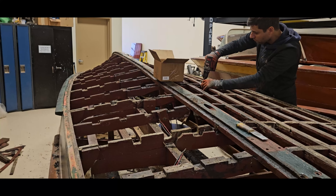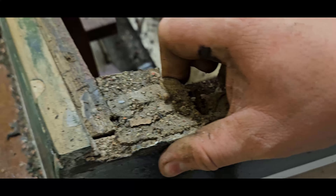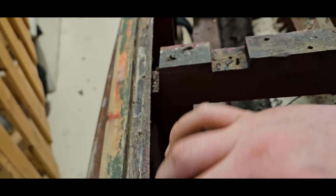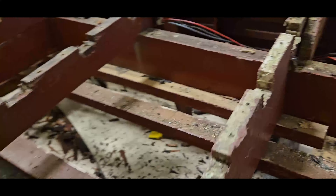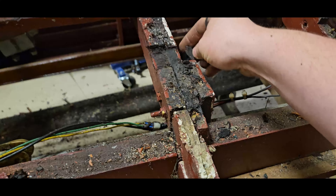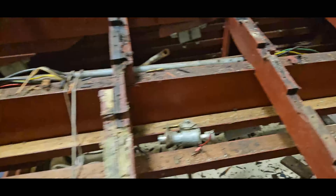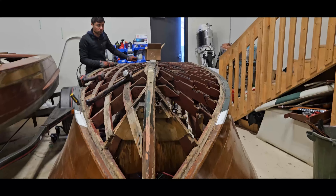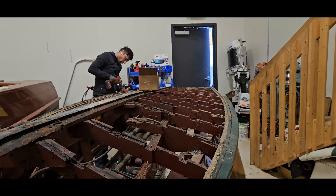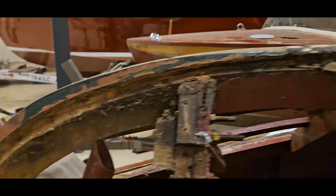We're going to try to work our way around that and see what we can do. Down here at the batten, we've got lots of old rubber silicone stuff holding everything down — this is all going to be cleaned up. We'll make sure all these edges are nice and clean for our new sealing surface, and we're going to go through and make sure that all these frame pieces are sturdy enough to accept a screw. If they're too rotten then we may have to replace that piece, but it's pretty simple — just put a new piece of wood, mark it out, cut it out, install it. That's going to do it for the video today.